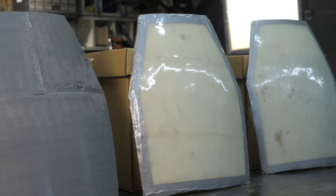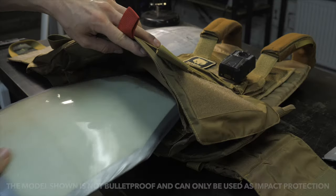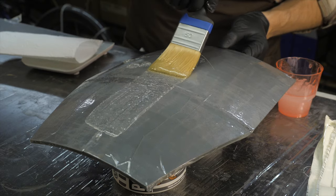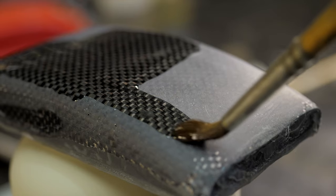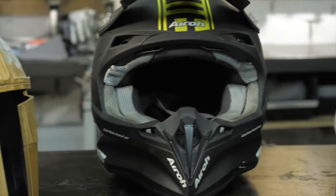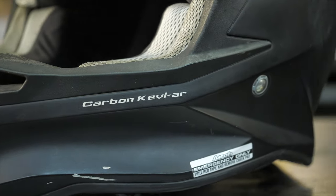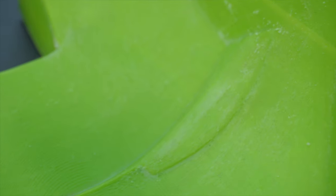In the last video, using the example of an armor plate for protective motorcycle equipment, we figured out how to make a piece of fiberglass in a simple 3D printed shape. The composite was laminated on the outside of a simple curved piece. However, in a large part of your composite projects — such as the case of remote control modules or a motorcycle helmet — the surface has higher detail, sharp edges, sharp bends, much higher requirements for the ratio of weight and strength, and most importantly, laminating is done along the inner surface of the concave shape.